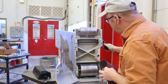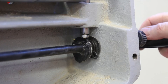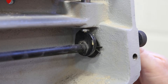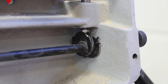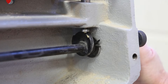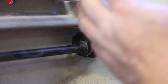Let's zoom in and I'll give you a closer look. We're at the top right now, so if I loosen it off everything drops. Put the sandpaper on, lift it up — clunk. But what was happening was the sandpaper — I don't know what has happened, whether the sandpaper is being manufactured differently, maybe to a metric standard where this is an imperial standard — but we could only get the handle to about here. So after vibration it would just loosen off and then we'd start getting tracking issues.